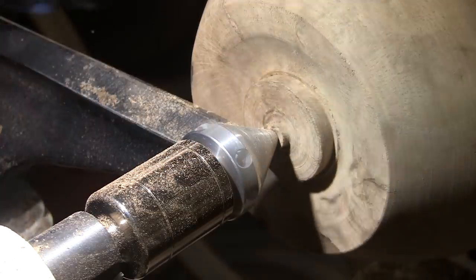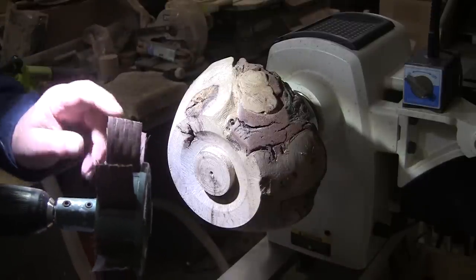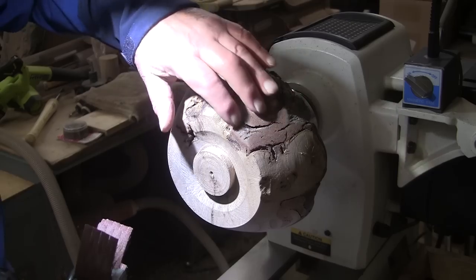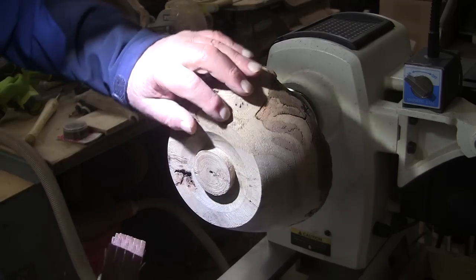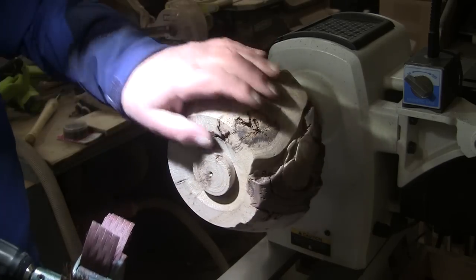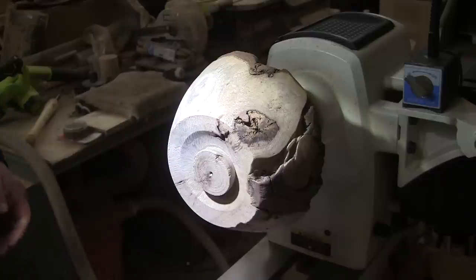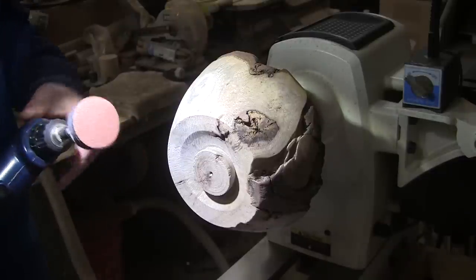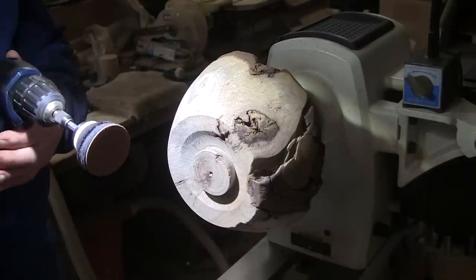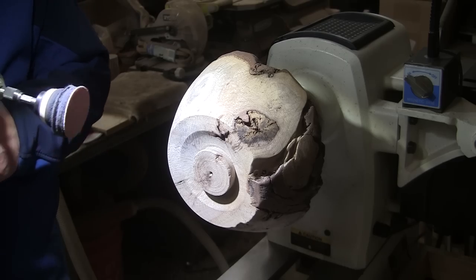And that's good — time for sanding. I'm going to start the sanding with my SandoFlex at 180 grit, and that's as fine as I will go. I'll be sanding all of these bark inclusions, little notches here and there, all the ins and outs of the piece, and along the top as far as I can reach. When I'm done with that, I'll switch to my two-inch disc starting at 80 grit. I'll have the lathe spinning in reverse at 350, and I'll work up through 400 grit.